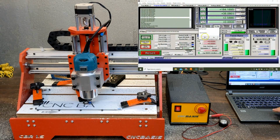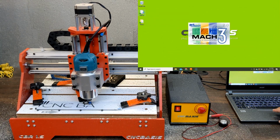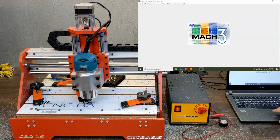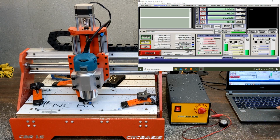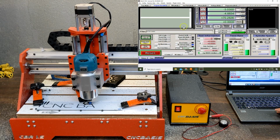And restart Mach3. Notice that I have left all different stock and hold down clamps in the way on purpose and the machine has not crashed once into any of those. That is because we're using Safe Z with machine coordinates. I'll explain that later. Also, notice that every time the job finishes it goes back to a corner or a rest position that we have selected. Or set. That is because we're using a G28. I will also explain it later in this video.